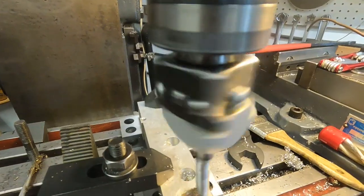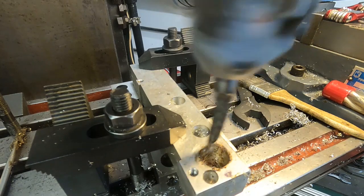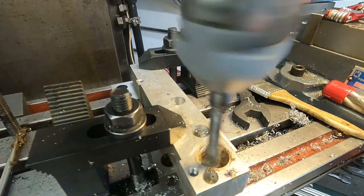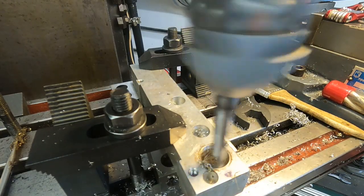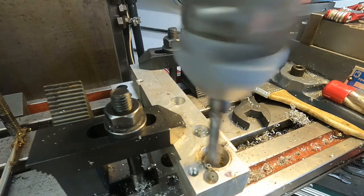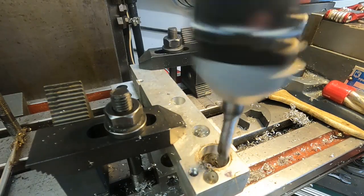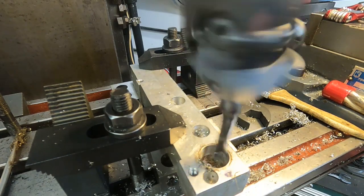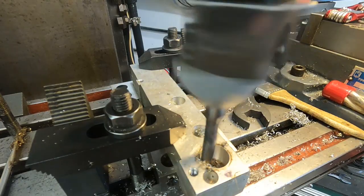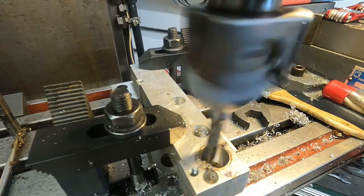See if I can get a little closer here. Now last time it cut it 1/1000th over, but I don't think I have the spindle warmed up enough. And that spindle's running 980, and I'm slowly hand feeding this in. It has a fine screw that moves the quill instead of rack and pinion. The finish is looking pretty acceptable.